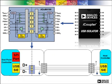The ADUM4160 is an integrated single-chip USB isolator. It's designed to provide isolation in the D-plus and D-minus lines, so it works with existing USB ports. Using this product is as easy as providing enough board space to place a 16-lead SOIC package and routing the D-plus and D-minus lines through the chip.